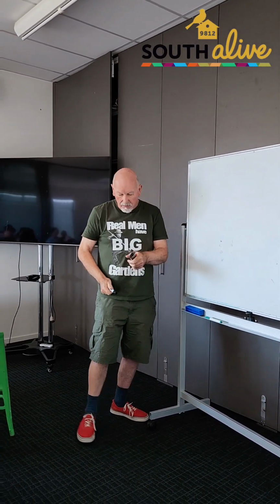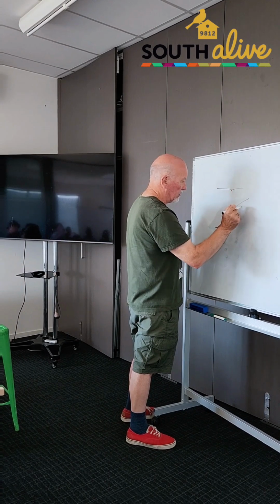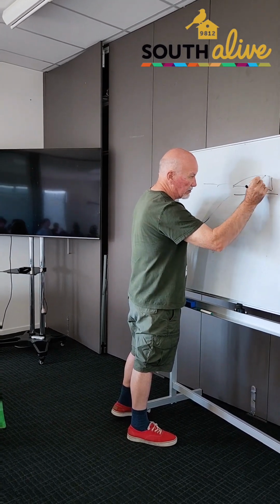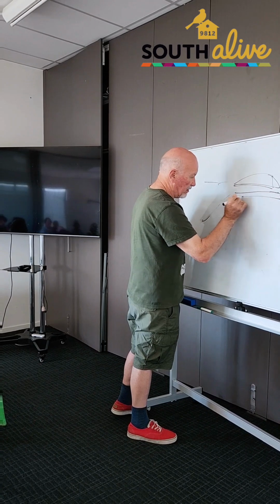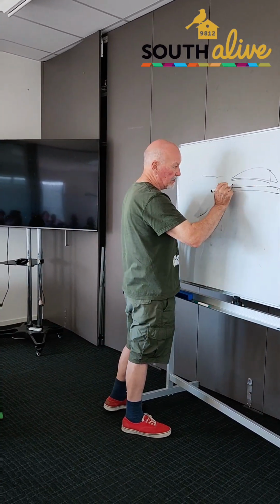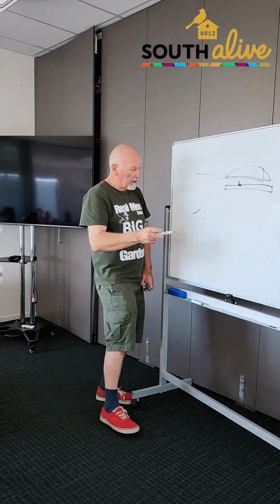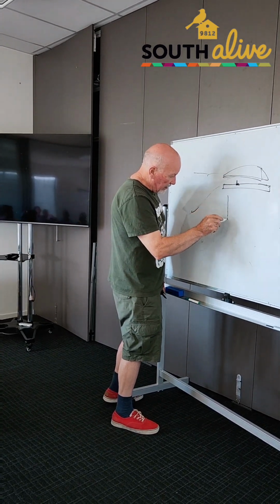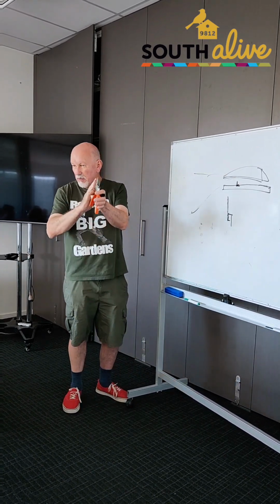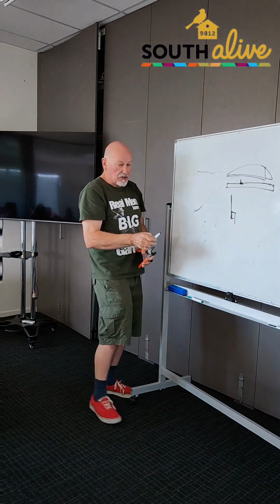So this pair is what we call an anvil. If we blow it up, it's got handles, etc. like this. Very poor diagram. So it has handles, and then it has a blade at the end like that, and that shuts on a flat piece like this. So the cut is formed when this comes down and it just jams against that flat surface. The other type is where the blade, looking end on, goes past a point like that. So the blade comes down and it shears past it. That makes sense? Cool. So you sharpen them differently.